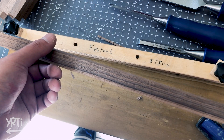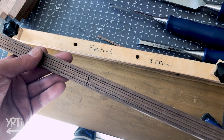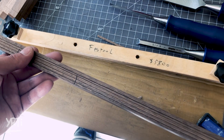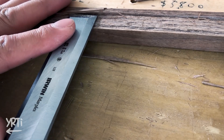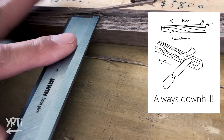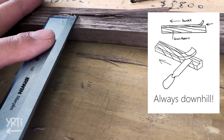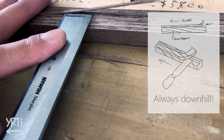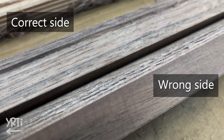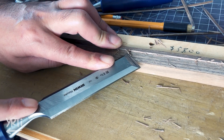Here's a quick view of a useful tip to mortise where you fit kumiko. I wanted to take one sixteenth of an inch off of the frame wood. So first, I cut in a bunch of straight lines with a marking gauge, and then scraped the waste off with a chisel. It was so easy. Just so you know, when doing this, you should be careful which side to go from, as shown in the picture — this makes a huge difference in the finished surface. I cleaned them after.